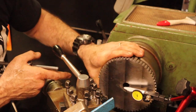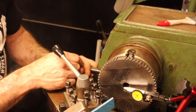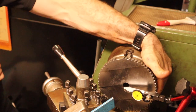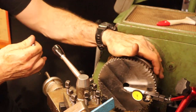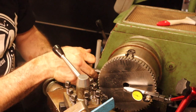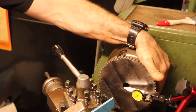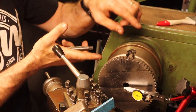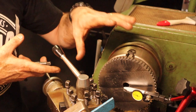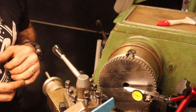If I look at it, that's about the highest it reads. So I want to go to the opposite side, loosen it just a smidge, then flip it over and tighten this side just a smidge. That should hopefully - well, that was too much. That's why I'm using the four-jaw chuck so I can move the disc left, right, up and down to get it just right - perfectly centered in the chuck before I start cutting out the bits I don't need.